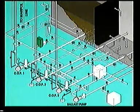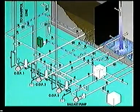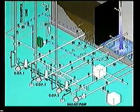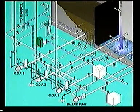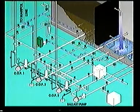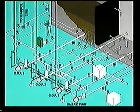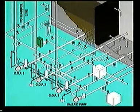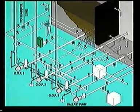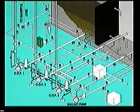During the tank washing, you should take the opportunity to flush clean water through the full length of the tank wash line. Flush the deck wash line and all guns with clean water for a brief time, and drain the whole line when it's no longer used. The clean slop tank must be purged and ventilated in the same manner as the rest of the vessel's tanks. This can be done relatively quickly.